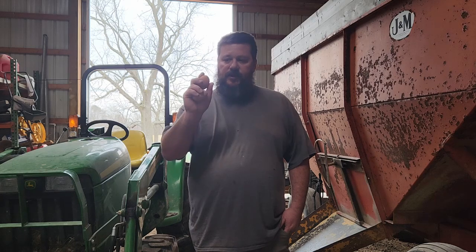So I guess when it comes to electric fence, I use that old hot dog stick to test everything with. But so I have 4 places that come off the barn, 4 different directions. I eliminate all of them. I'll go back and I start hooking them up one at a time to see which ones I'm getting the most arc off of. So basically you're taking that handle or whatever it may be and you're touching it to the power, but it's a ground on this side because it's shorted out somewhere. So out of the 4 of them, 2 of them didn't do anything to speak of, one did a little bit, and one of them popped pretty good when I hooked it up. So I knew that was grounded somewhere down that line.